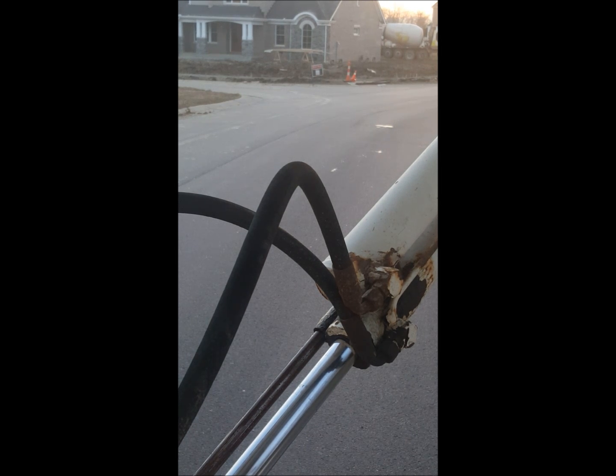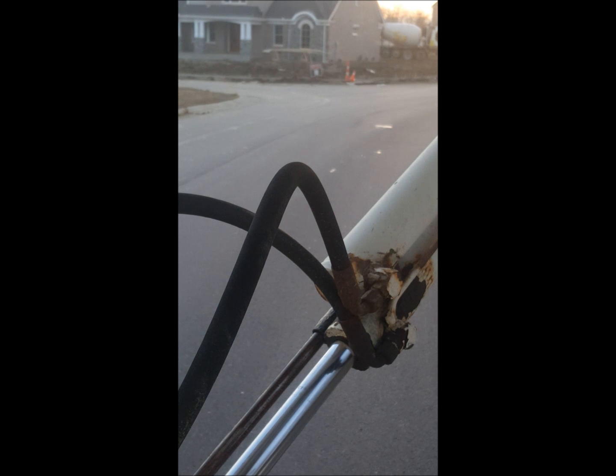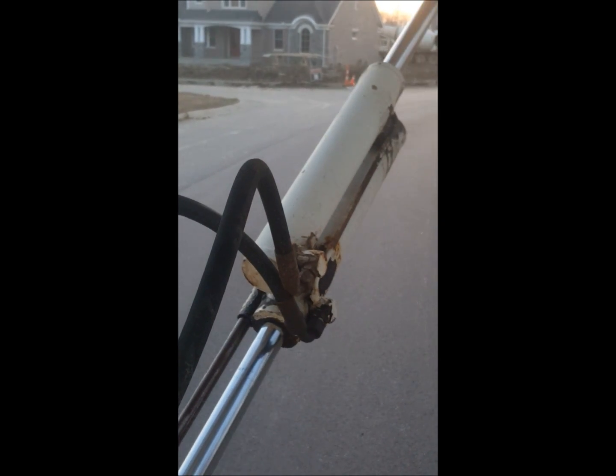We'll find out what our slump is and put our chutes on. I'm going to call ahead to the driver in front of me — 182, Gary. It says a six slump on the ticket, is that what they want? We know they do want the slump on the ticket, so while I'm putting on my chutes we're going to add water to get it up to slump. I'll use my cruise, have my truck rev — it saves time to do this all at once. Once I add water I should be just below a thousand on my meter, on my slump gauge.